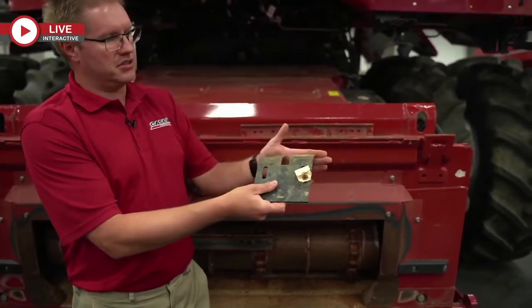A question from the live crowd asked where exactly the sieve pressure sensors are. Right where my finger is — that's the sieve pressure sensor right there. There's one above the top sieve and also one above the bottom sieve, on both sides, so we're monitoring both sides. Again, use duct tape when washing in there, or if you've got really green sticky canola it'll get coated. It's an air pressure sensor, so just take a soft bristle brush and brush the green stuff off. Those brown things are little filters over top of the air tubes.